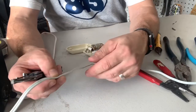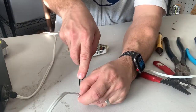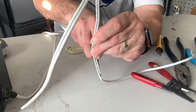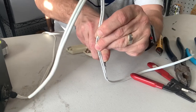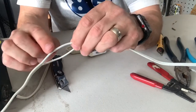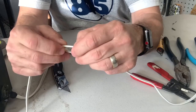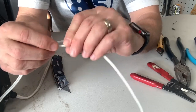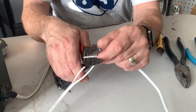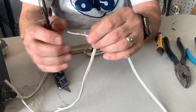Get yourself a nice sharp razor blade and cut right through the wire down the middle — that's where your switch will go. You want to be about three inches down. Then cut the smooth end. You can see one side has rib marks and the other is smooth. The smooth end is your hot wire and the ribbed end is your neutral wire. Go ahead and cut that right in half, taking off about an inch on each side.